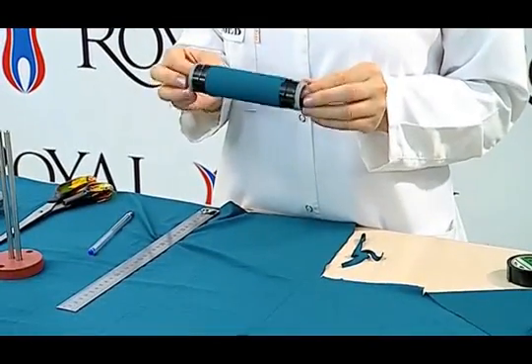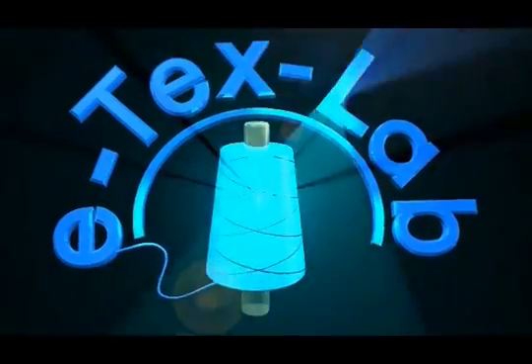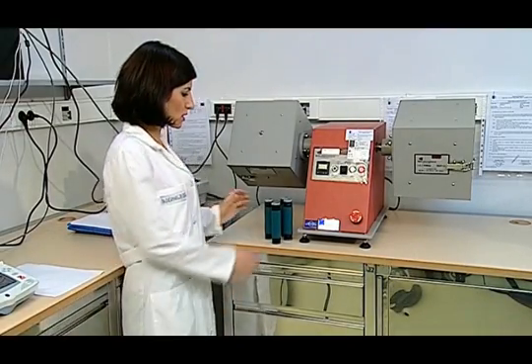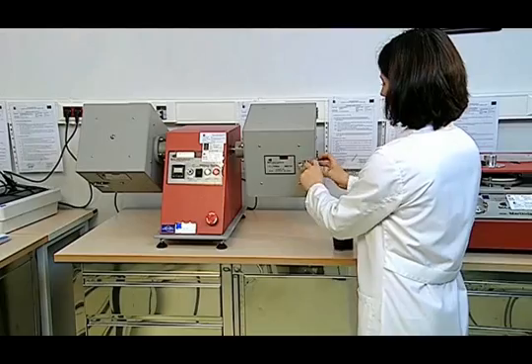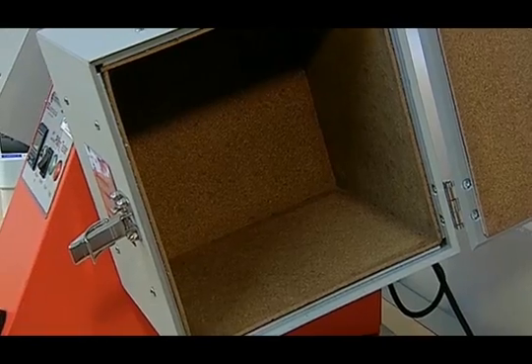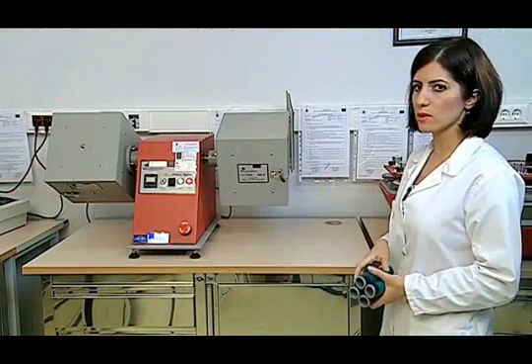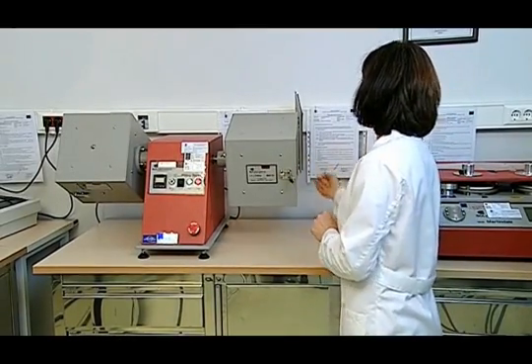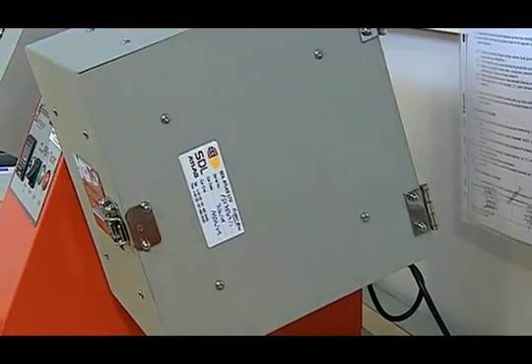In this way, we prepare the remaining three test samples. The prepared test samples are tested in a pilling tester. The cover of the device is opened to test four samples in the pilling box tester for surface fluffing and pilling. Our device is covered with a cork lining surface. It is checked for any fiber dust from earlier tests and cleaned if needed. We then put all four of the prepared samples in the same box and close the lid of the device.